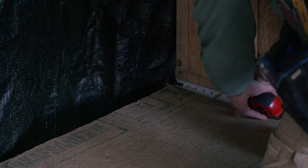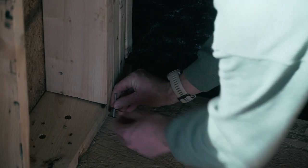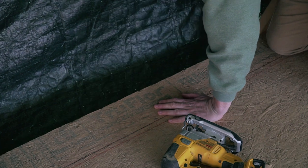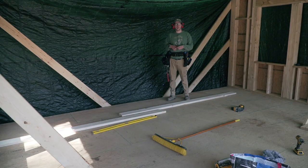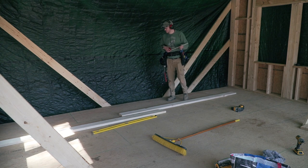The first step is locking my bottom plate five and a half inches from the edge — I'm going to do the same thing on the other side. Now I'm going to use a chalk line; you can use a nail to put it in place. I still have some of the sheathing sticking out just a tad bit. In the middle I'm going to have my door opening, so that's where I'm going to break the bottom plate, since I'll end up cutting it anyway to fit the door.